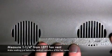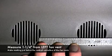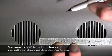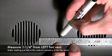Measure out 1.25 inches between the two fan vents on the top of the canopy with a permanent marker. Place the mark just below the center line of the fans. This will ensure that when the power switch is installed here, it lays completely flat on the top of the canopy.